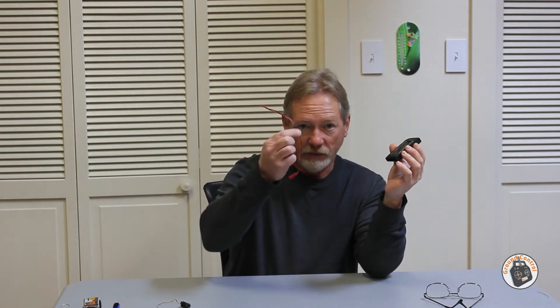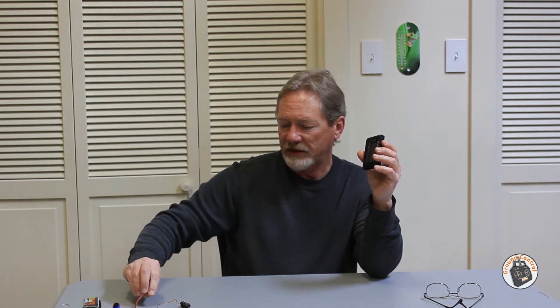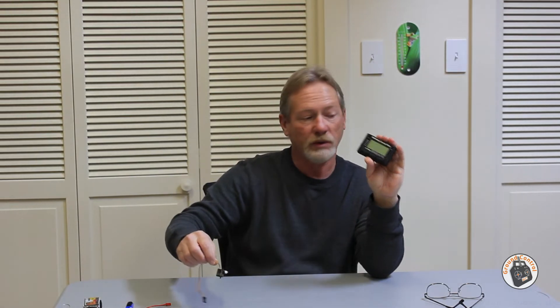You could use a BEC from a speed controller, or a little voltage regulator. These little red JST connectors slide right over those pins, so that's what I use with a little 2-cell LiPo to power it, because it also works as a servo and ESC tester. It's real handy to just quickly connect up the 2S battery to this without having to pull out a receiver or a standard servo tester.